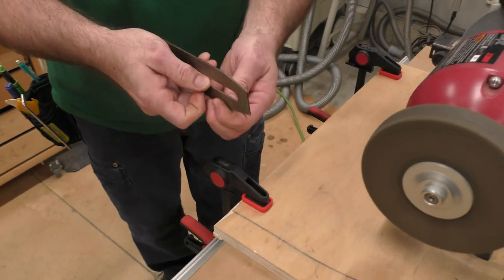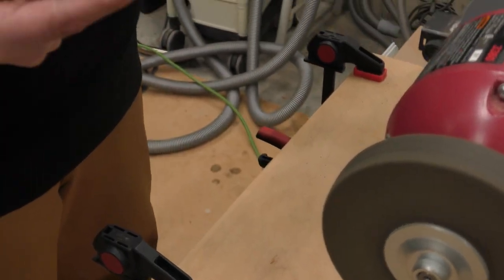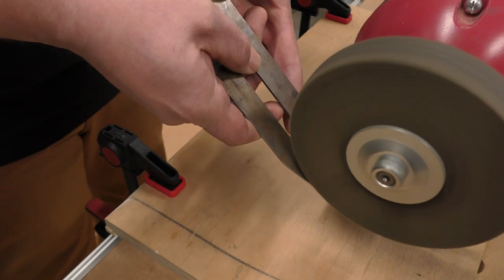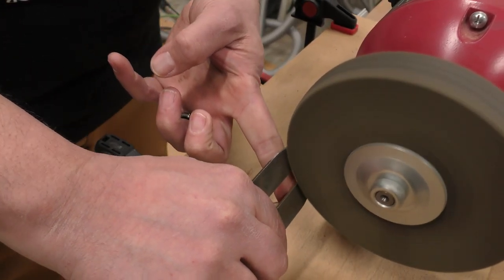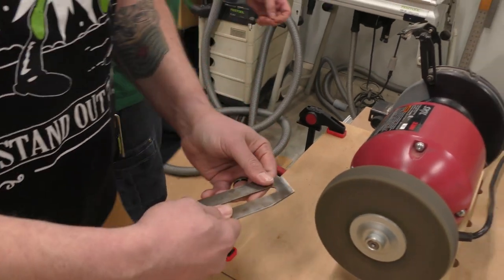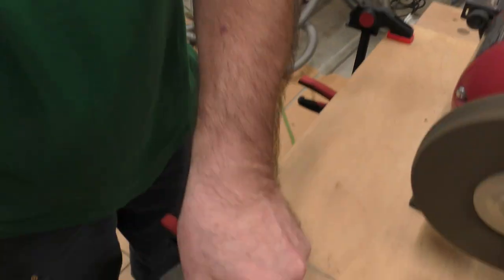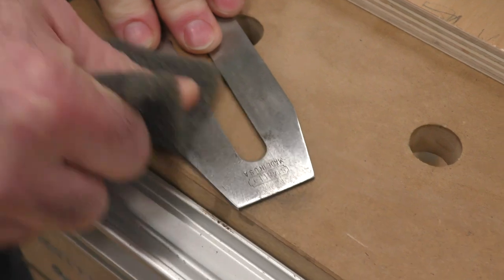I'm going to have you do this, just like I did that little edge right there. Just hold it firmly. So what else I want to have you do — you see that side right there, work on some of that stuff. Sand it off. It's just taking your time with it and understanding it. Then try it like that. Take your time. These are also known as blending wheels, finishing wheels — they won't take things down. I'll have this piece of scotch brite nearby, and after a while I'll take it and see how it all blends together afterwards. It really speeds up that operation.